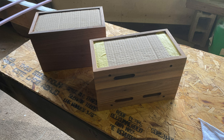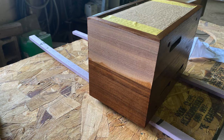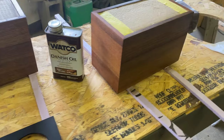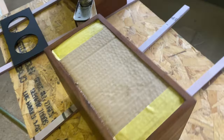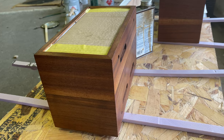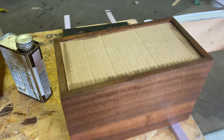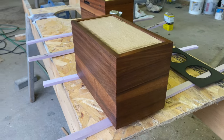Both cabinets are completely prepped and ready for finish. I'm going to be doing Danish oil. That's one coat of oil on the first cabinet — you can see the unfinished cabinet in the back for contrast. The Danish oil is a pretty dark finish and really brings out the grain. I really like working with Danish oil — it's a pretty easy application process: put on a coat, wait about 15 to 20 minutes, wipe it completely dry, then let it cure before buffing and putting on another coat. I ended up going with three coats total.